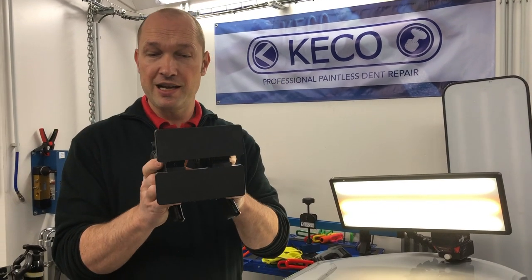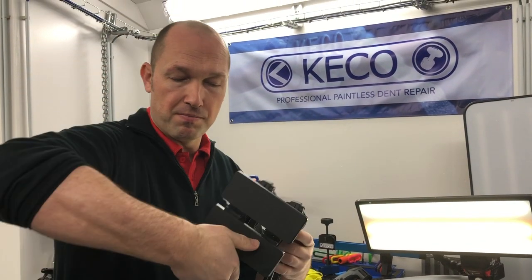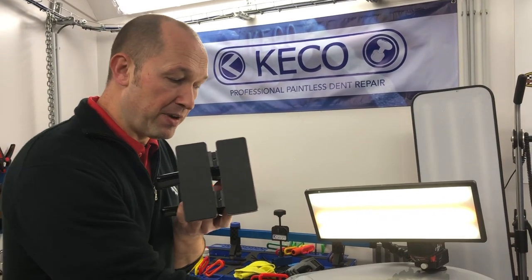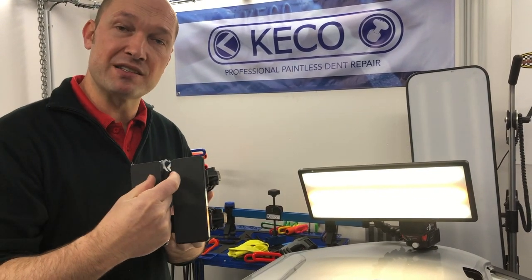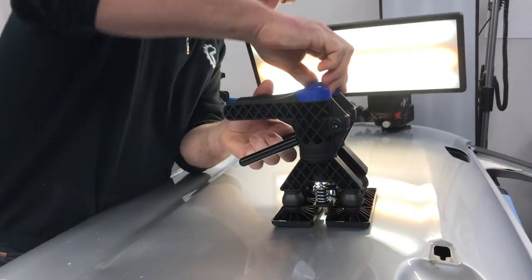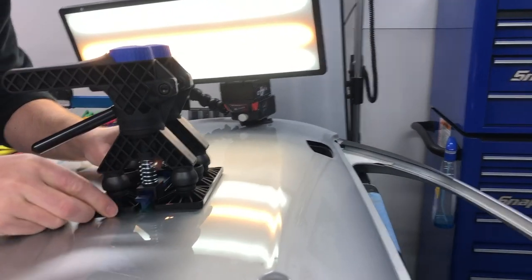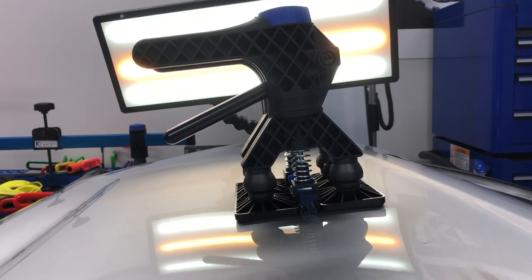The tool we're going to demo is of course our Crease Killer here. I've mounted the feet — you can mount them both ways, the feet further apart or closer together. I've chosen to be as close as possible to the centipede to make sure we'll remove that crease as high as possible. You can move the feet the other way to make room for bigger centipedes. Just make sure you can slide it over and lower down those adapters. As you can see, that centipede just fits right in between those feet.